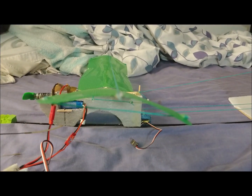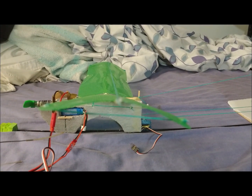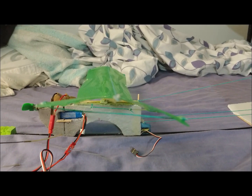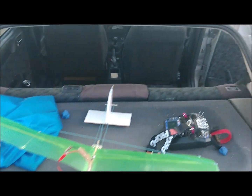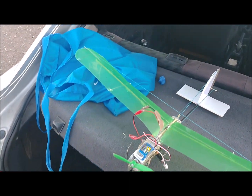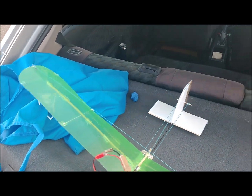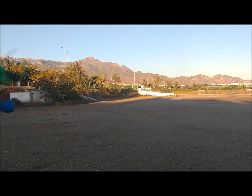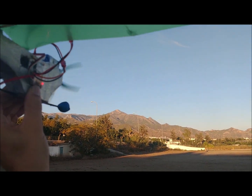Typical glider airfoils usually have a thickness of 12% of the wing chord. We have reorganized the electronics to place the center of gravity at 45% of the wing chord, and positioned it at the height of the motor thrust line. We have also removed the fins of the horizontal stabilizer, as we do not need the area and they create too much drag.